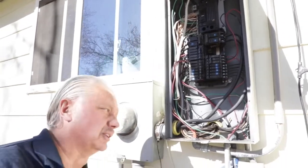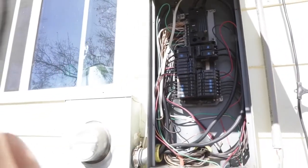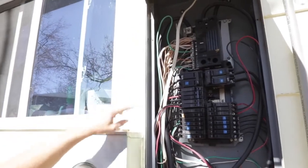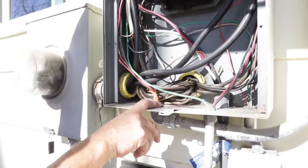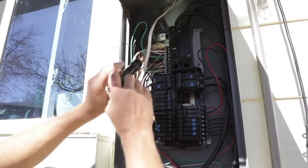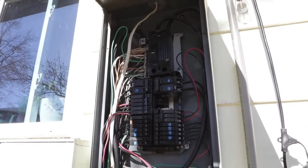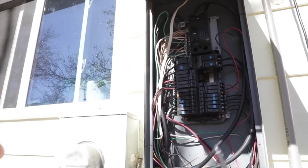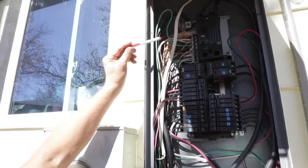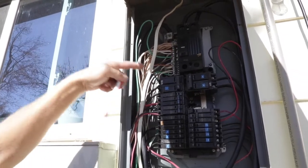Normally we put on gloves and wear shields, but for the video that doesn't work so well — just understand you do want to wear your protection equipment. So we open up the panel. First thing we're going to do is take some pictures. Typically we wouldn't see this extra insulation from an electrician. We are required to have at least a quarter inch. This is not a technical defect, but it just tells me we've had people in here that probably weren't an electrician. We're going to look at what our service wires are — they're aluminum. What are our 120s? I'm seeing a lot of aluminum 120s. When we point, I either use my plastic stylus or a plastic pen to show clients a problem.